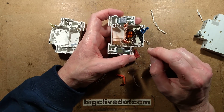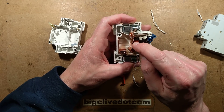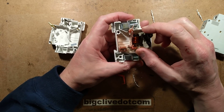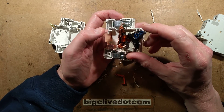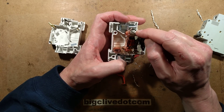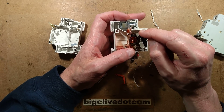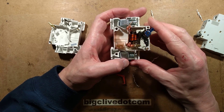What are we seeing? For a start, the coil here is just literally two really thick turns. There's a bimetallic strip, and it's relying, by the look of it, just on heat through the actual unit — there's no tap-off. Some bimetallic strips have a tap that passes a certain amount of current through the strip itself and uses a heater, particularly in low current breakers.